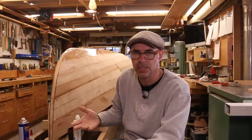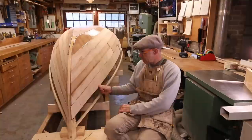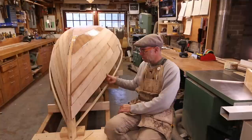All those things caused me to jump through a bunch of dumb hoops that slowed me down. In the end I still had to go out and buy another sheet of plywood. This time I smartened up and just cut it into eight-inch wide pieces to get my sheer planks out of. If I had just done that from the start, I probably would have shaved off a couple hours of fussing around collectively. I've left these planks particularly wide — a full half inch extra — partially due to laziness and partially because I wanted a bit of wiggle room.